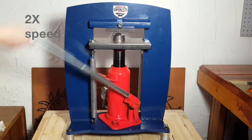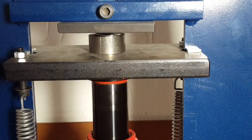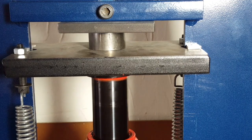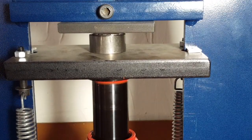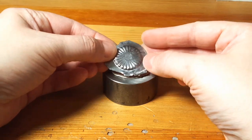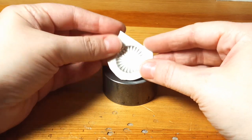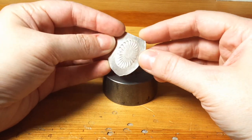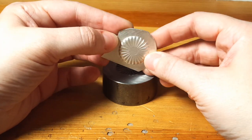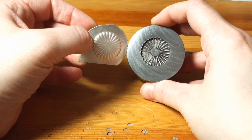After you have your sandwich put together, it's time to head over to the hydraulic press. I've placed my sandwich in the hydraulic press and I'm pumping the jack to raise the lower platen. Once it meets the top platen, the lead will begin to be smashed down into the silver, which is then pressed down into the impression in the die, creating the stamping. Now let's see how it came out. This top piece is the lead, and if you flip it over you can see it's taken on the form of the die — that's what we want. This is the finished silver stamping. Looking at it from the back, the impression looks pretty good. The front looks good too — it picked up all the details, so I'm pretty happy with it.